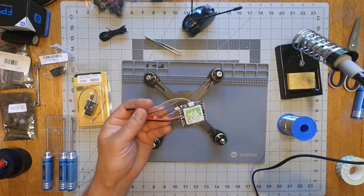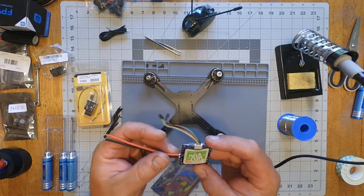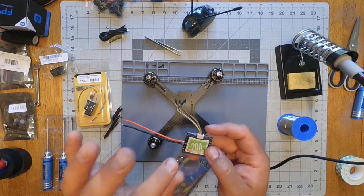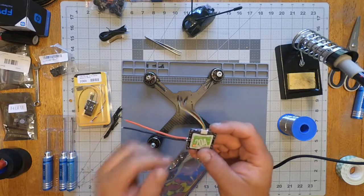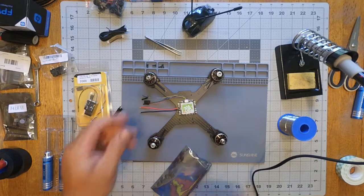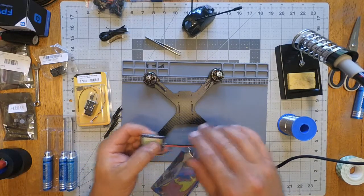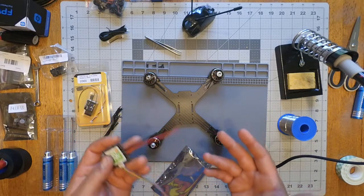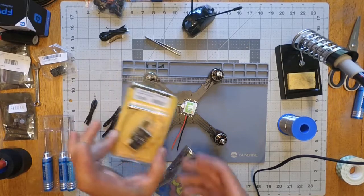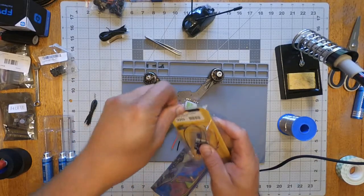All the links will be in the description below. Most everything else is from Banggood — got buzzers and everything. I'm only using a 20 amp ESC because it's got 5V BEC, and I'll be running the camera and VTX straight off of that, just like I did on the Genius 215. No PDB needed — it works fine on that build so it should work fine on this one.